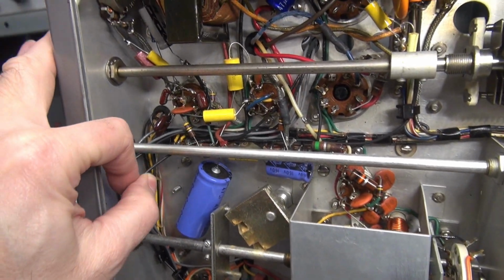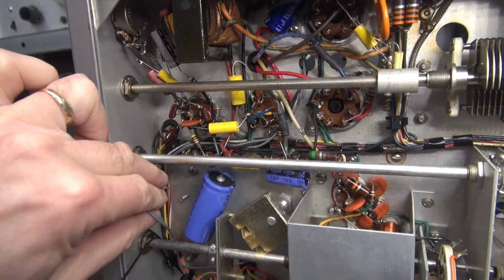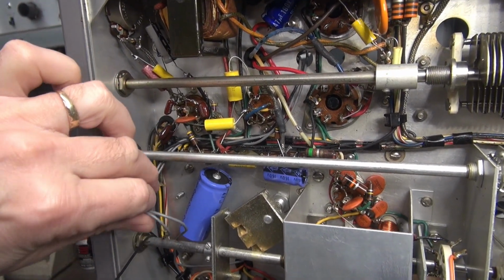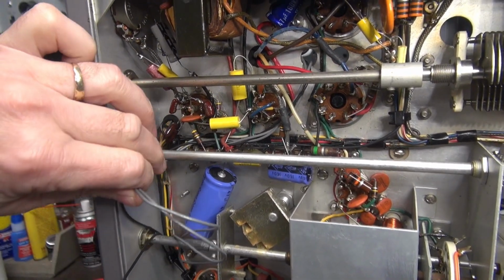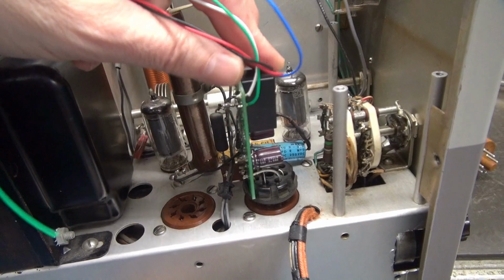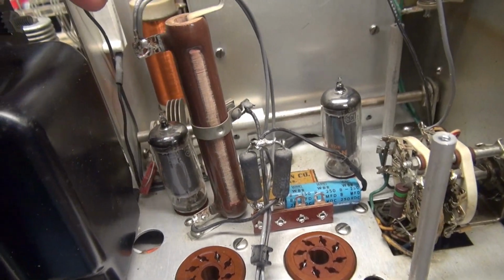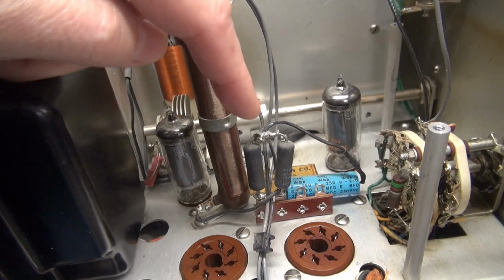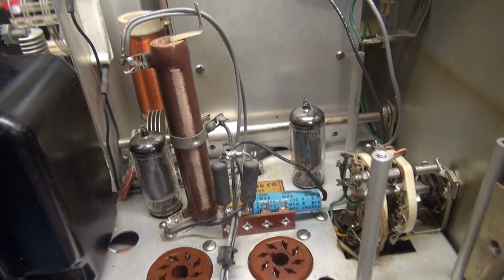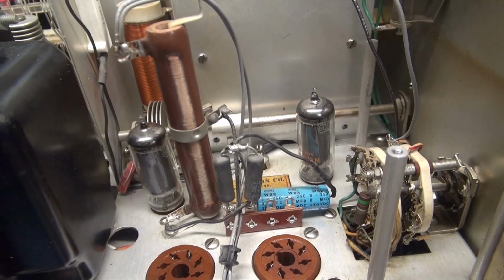Now here's another example of why you don't want to start rearranging things in your radio. All this wiring with the switching and the high voltage DC going to those relay contacts was going right through the audio section. So there's a good chance that was inducing noise. So it's a good thing we're getting this out of here. So I'm getting ready to install the K1, which needs to go right here. As you can see, I've got interference fit because of these added resistors. So this modulation resistor is not the right value, so they lowered the voltage with some more resistors in this terminal board. So since I'm going to repair push-to-talk first, I'm going to go ahead and remove this so I can get access and do a clean job here, and then we'll attack the modulation problem later.